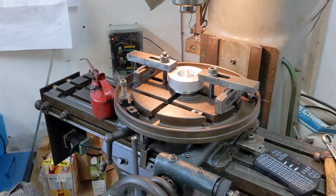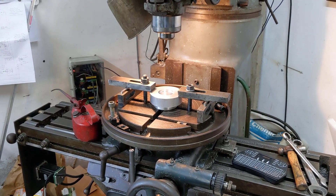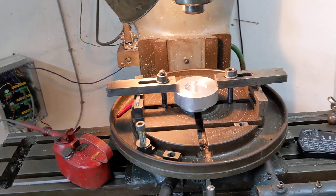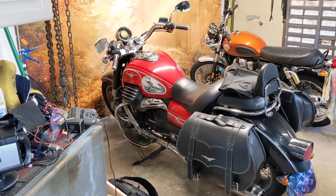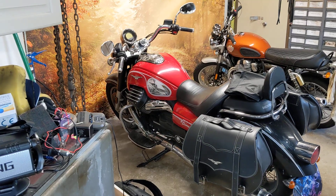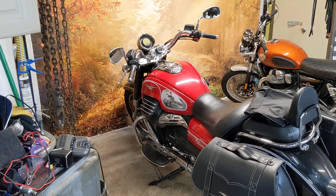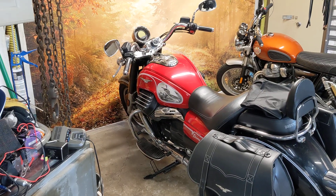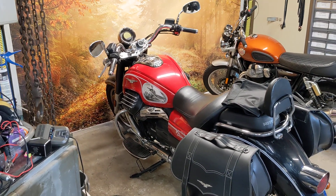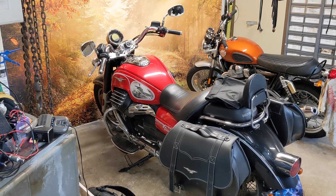When the part is finished — which should be later today — I'll drop a quick update so you can see the two finished sprocket spacers, then it's on to the next job. Meanwhile, to my right — turning 90 degrees — the mighty Guzzi is back together. It's got new tapered needle roller bearings in the head, and I had to make a special tool last week just to pull the bearing in. I've done about 450 miles on it in the past week and it's brilliant — handles much, much better. Also, putting some air in the tires made a big difference; the front was quite low, which doesn't help.